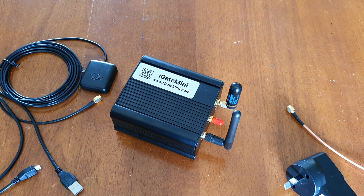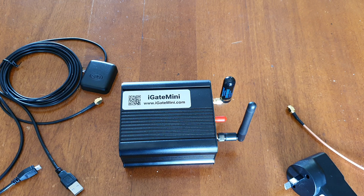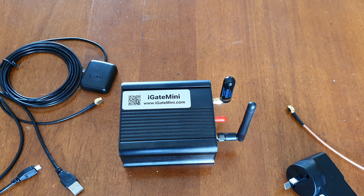We have a digipeater about 30k away. I haven't set up a digipeater for various technical reasons, but the digipeater in the area is really good — it just doesn't cover our area too well. We have a lot of hills and it causes issues getting packets from vehicles locally into the system, which is the main reason for the i-gate. Our i-gate now receives all the traffic from the digipeater sometimes up to 100k away and the whole system works really well — we're complementing the APRS system in our area. Thanks for watching and I hope it was helpful.